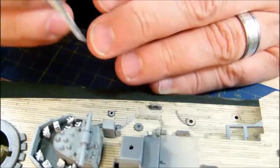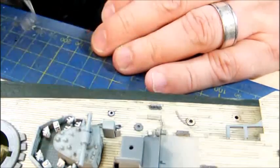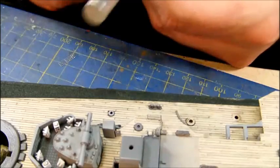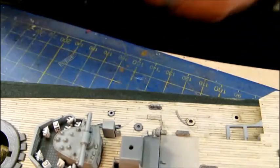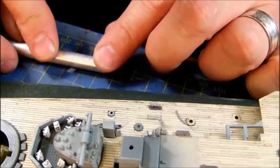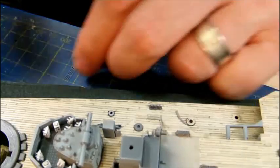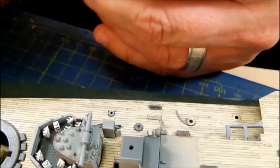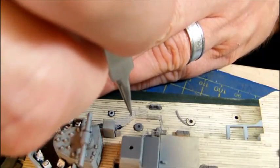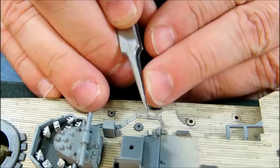I just need to open the curve just a tad bit more. The next mandrel is a bigger diameter. I have to be very careful because if I'm pushing too much I'm reversing the process — very gentle, very gentle rolling, only the top part. This is probably already too much. So it's trial and error all the time, and if you want a precision model there's not much in the way of going around the procedure like that.